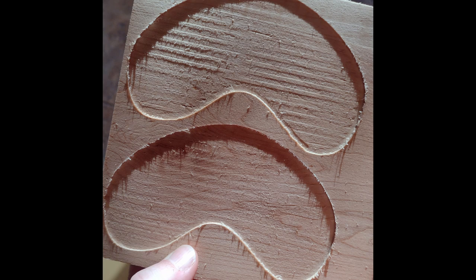I mentioned this in the previous video, but I stacked the deck against my CNC machine. I did an 80% step over for the toolpath, pushed it to 150 inches per minute — faster than it would normally go. I found a dust shoe with the longest, stiffest bristles I could find, used the shortest bit I had, and it caused that deflection. I know in the future I will never use that dust shoe with that bit, and I know how to avoid those results when I want to.